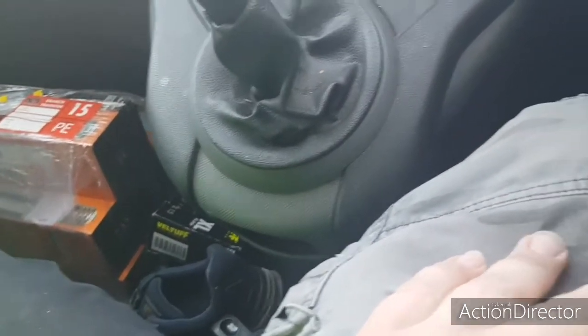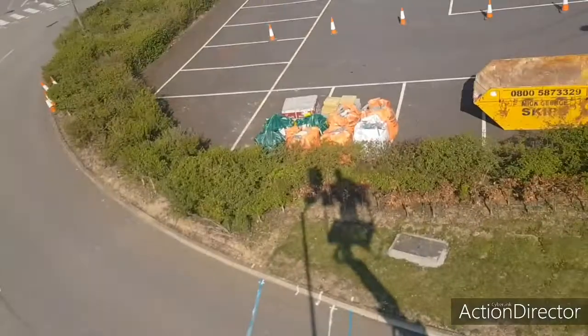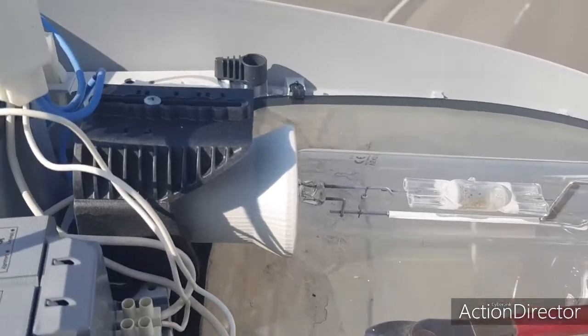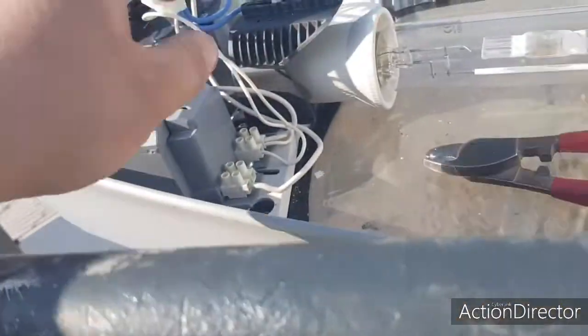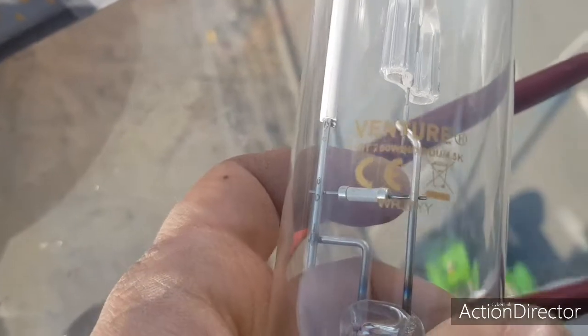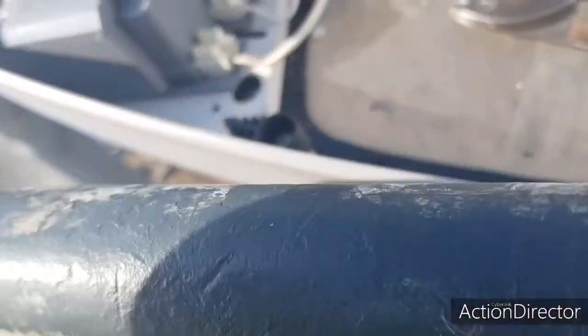We are a little ways up now. This is what we're facing: a 150 watt lamp ballast and igniter - it's blowing its fuse, ballast is gone. Getting a new one, changing it to an LED. It didn't last long - you can see it's a 250 watt metal halide lamp on a 150 watt ballast. No wonder it stinks.